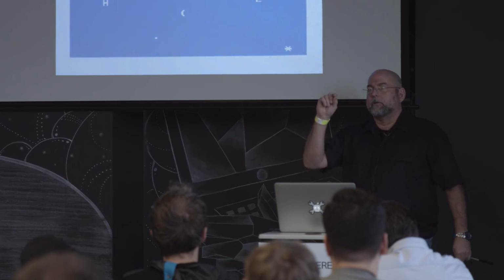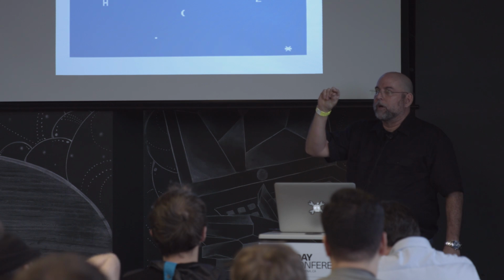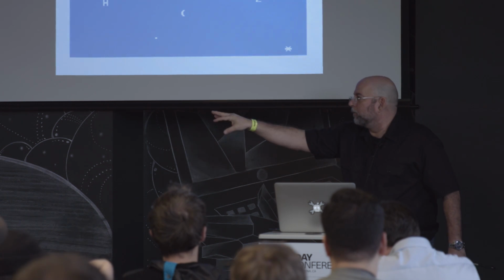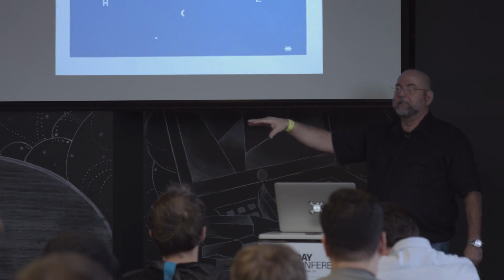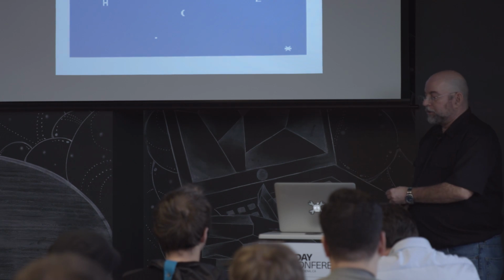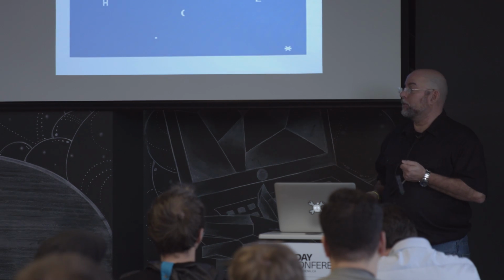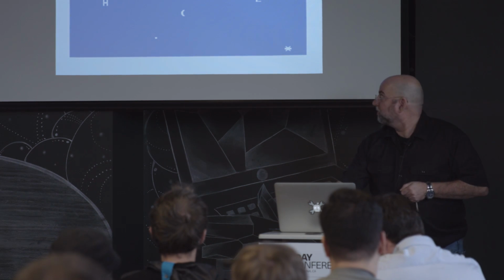We traced it to a trace on the board about 1/8 of an inch long, where when you wrote 11111110, the ground bounce would make it into 11111111, right? So we fixed that in enough time. I mean, we were able to put a jumper on there. But this is the kind of thing that when I go for my final PC board, if it does this, we're screwed, right? So another fix, that was a couple hours. Now, we're almost to CES. Maybe I'll make it in time. And, you know, CES was everything, Consumer Electronics Show.